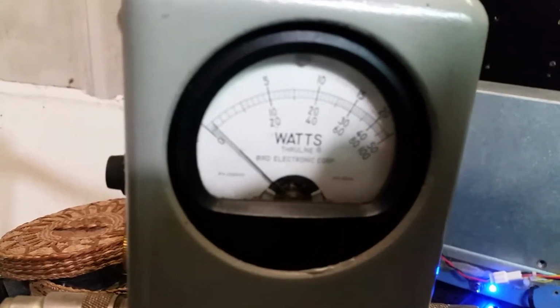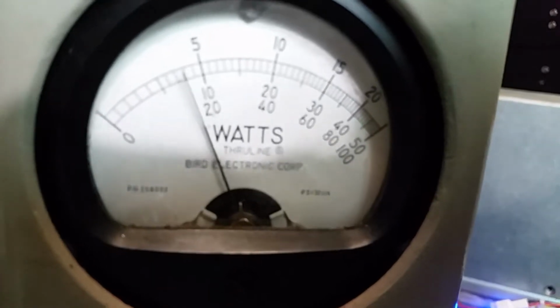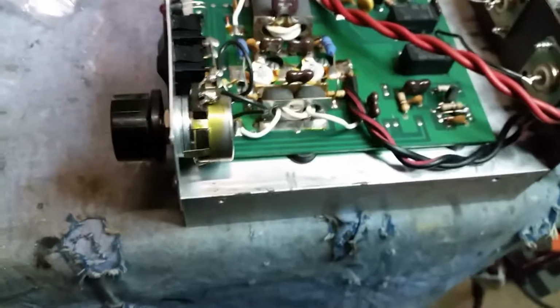So here is the amp working properly. Alright, this is the potentiometer all the way up. As you can see, real good low dead key. Oh, right there about 75. Bird. PEP. Oh, almost 180 watts. You can't see what it's called on the front of it, but you got 2 old school Motorola 455s in here, and she's a working. This is a Class C box.